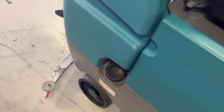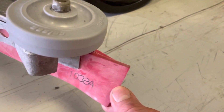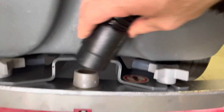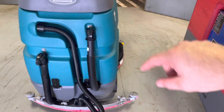The machine is very simple. It's got a squeegee on the back. The squeegee has two flaps of rubber. The front rubber has notches in it that let water in. The rear rubber squeegees that water along. The vacuum hose connects to the top of the squeegee, and the rear rubber pulls that water up into the recovery tank.